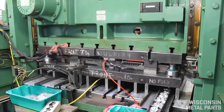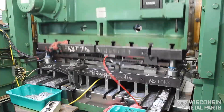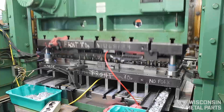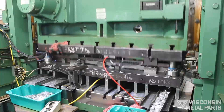There's stripper plate sensors to detect slug pulling, a misfeed detector at the end of the tool, and eight sensors that take an actual measurement reading on two features within the part. If these features do not meet the program tolerances, the press will come to a stop. This helps us keep non-conforming parts from slipping through into finished product.